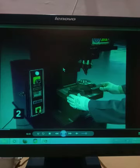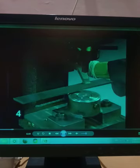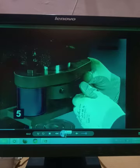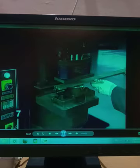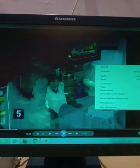Now what is the speciality of this punching operation? You can observe that the die is fixed here, and the upper part is known as the punch. The punch will travel from top to bottom, and it will travel without any resistance until it touches the workpiece. Let us assume that the motion of the punch started from here, and from here the punch comes down and touches the workpiece.